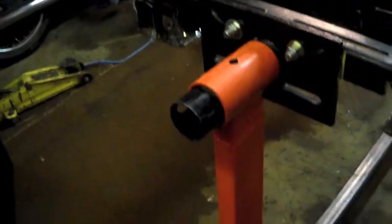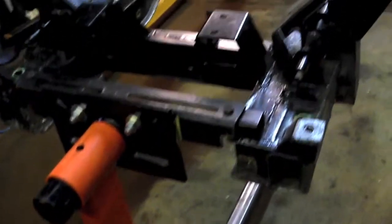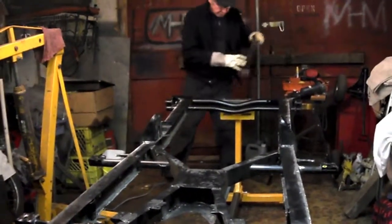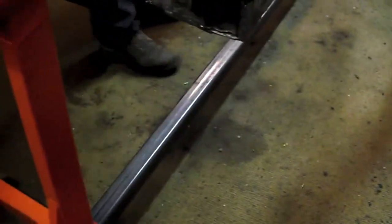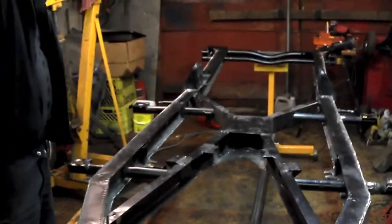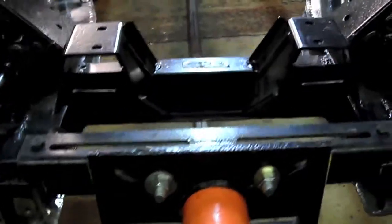So explain what you've made here. I actually have some photos to show a couple of stages of it. I took the upright parts of two old $40 engine stands and altered them a bit. I spent $75 on a piece of quarter-inch wall 2x2 steel tubing. That's about it. I welded on a little lock so the tubing doesn't wander off. It kind of explains itself.